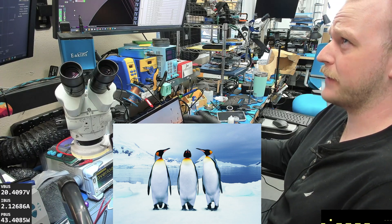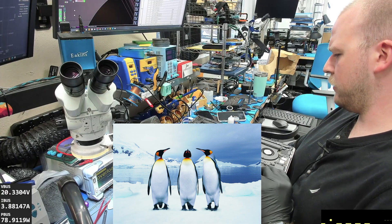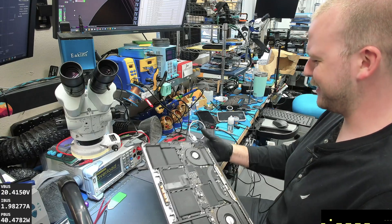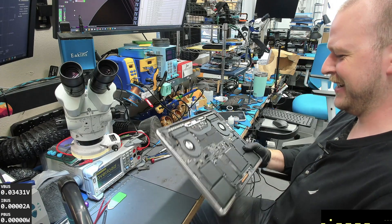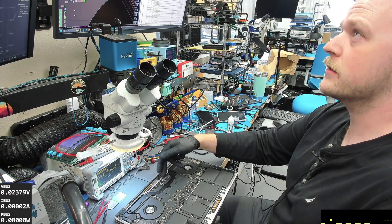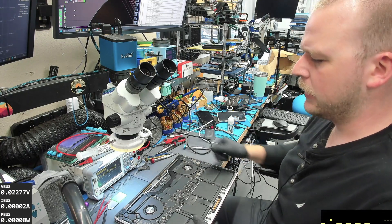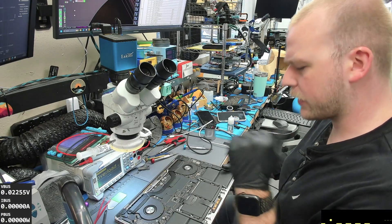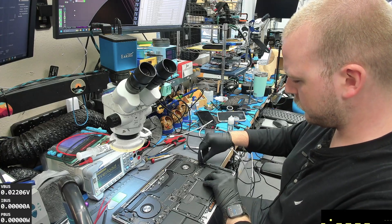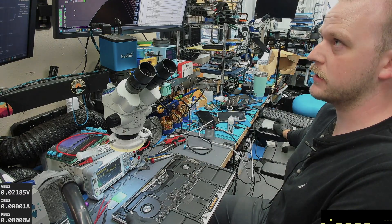This was for data recovery, but this should just be a working laptop so they can take it home and back it up. Don't solder stuff near the CPU if you don't know what you're doing — it's really easy to kill these machines. And don't take your boards to people that don't know what they're doing. I think maybe the guy just saw low-ish resistance around the CPU — like five or six ohms on coils — and thought 'short circuit, I'm going to start removing stuff.' Very bizarre. Doesn't really matter though: MacBook works now, and that is all we care about. We'll see you in the next MacBook or soldering repair video. Have a great day.